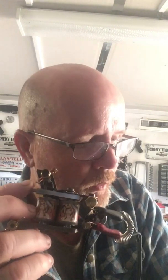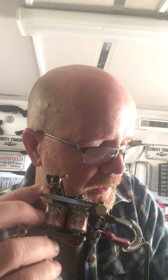The reason for that is there's less flex because it's shorter, so the armature bar won't travel up quite so far under tension when it hits the contact screw, so it does make for a slightly faster machine. I like to mix a short spring with an armature bar with the cutout on it, and that will give me much more of a hybrid machine, which allows you to use it for lining and shading, same machine, with just a tweak of voltage and obviously the gap to suit.